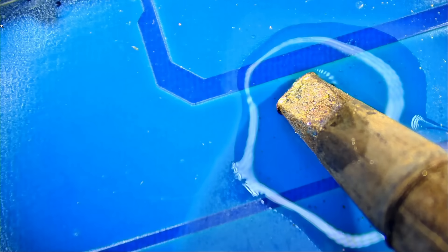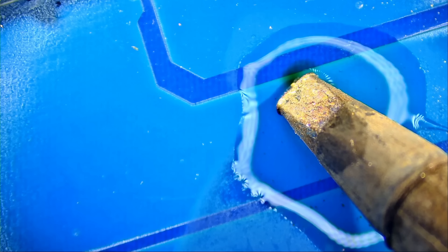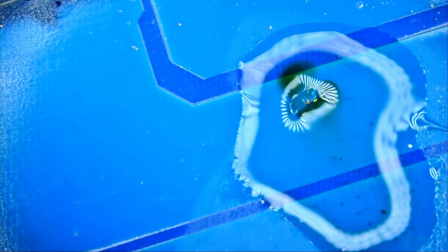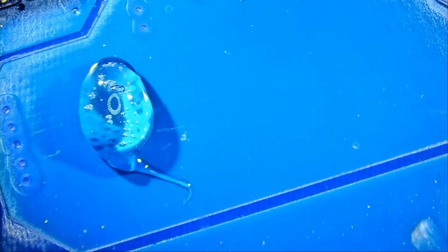You can see how the flux stopped bubbling in a few seconds. It became less effective — it evaporated, became less effective. And now it's burning. If you look at my videos, you can tell how I'm always applying flux to do a good job. The flux will work if you keep applying, but the properties of Rosin flux is it chars, it burns, it evaporates, and it will not last as long as ours.